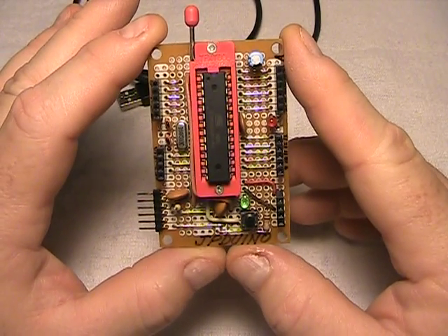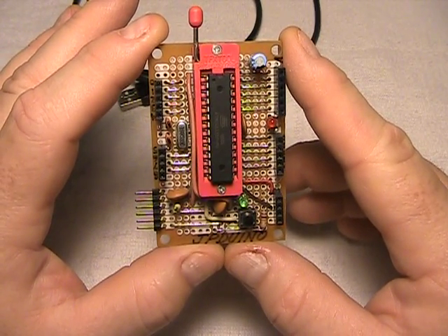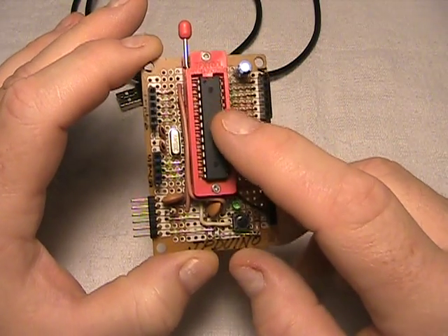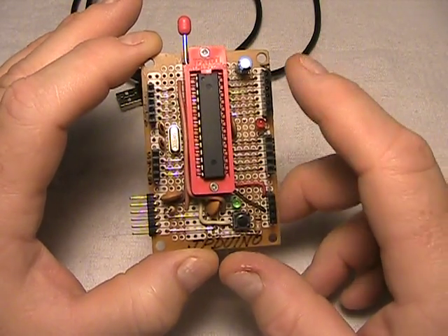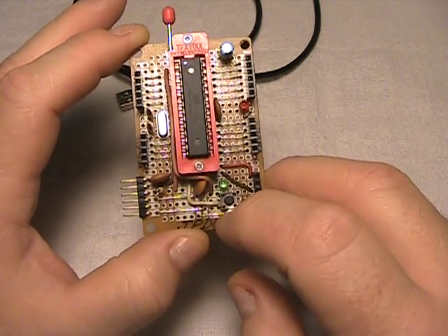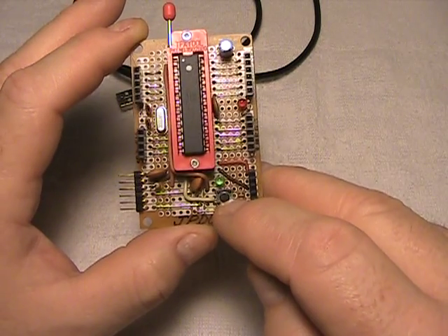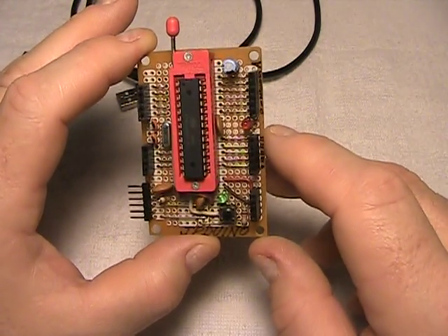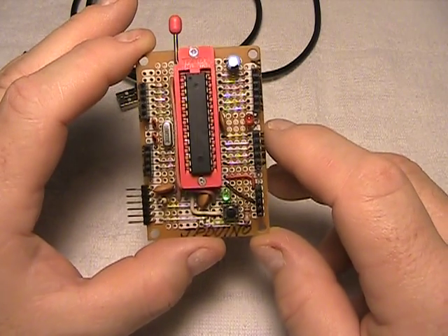The other concept was: once I decided I wanted to build a little product or project, rather than spend $30 on a dedicated Arduino, I would buy an Atmel 328 chip for about $4, a crystal, a couple of load caps, maybe a reset switch, and a power indicator LED — the bare bones hardware that I need.